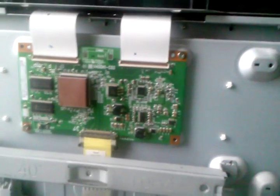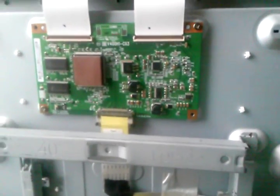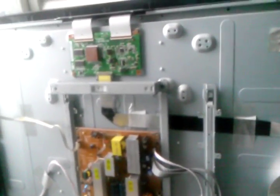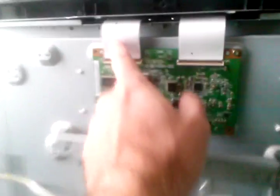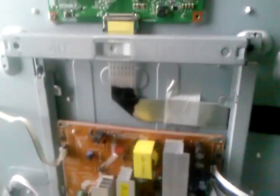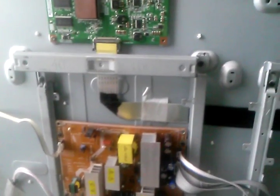That white screen is, again, indicative of a loss of data signal from the timing controller, but the display is nice and bright on half of the unit, and then when I switch out and disconnect the other side, I get the same thing. That leads me to believe that the LCD panel is fine. It's nice and bright. There's no dead pixels. It's scanning properly. Everything seems to be fine on it. I also checked all the voltages in here. It does actually have the voltages, believe it or not, listed here. I checked all of them. They're all fine.